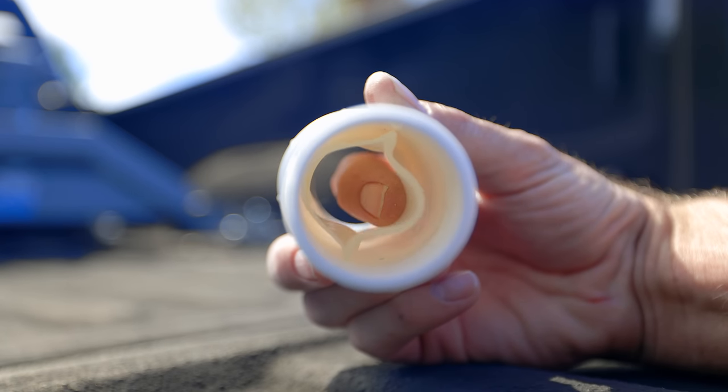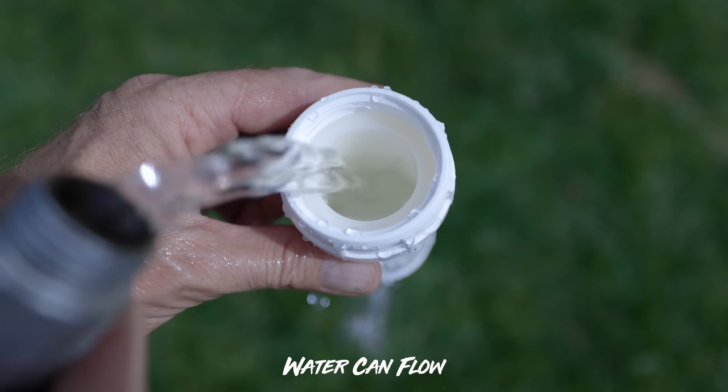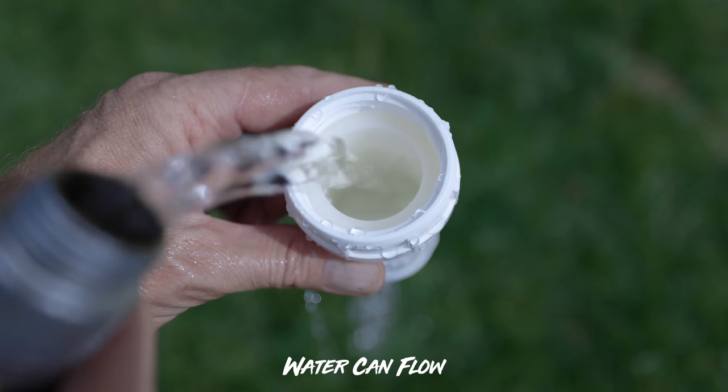What the HEPVO has inside is a rubber seal. It's basically like a balloon where the water can fall through and it'll allow that rubber seal to kind of open up. When the water's not passing through, it will close back up and create a seal so that the smells from your gray tank don't come back into the RV.